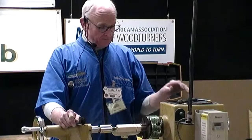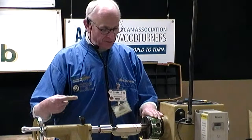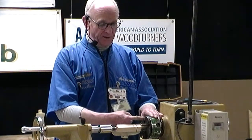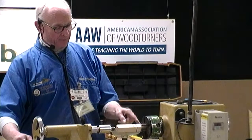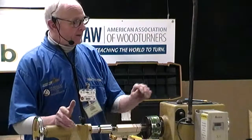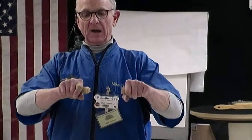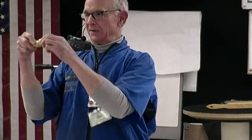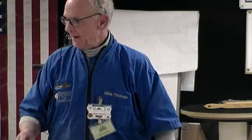And this is one of the things that he does: he uses spigot jaws, and just crams the blank into the end of the chuck, and he doesn't do what I did. I might mark the center on both ends so that this is in the center, held here. Otherwise it gets out around, and yeah, you can make a box out of it. The problem is you have to have it lined up perfectly. Otherwise it's kind of off like this when it's in there. This way, you can twist it, and it's always lined up. But when it's off center, it's really noticeable.